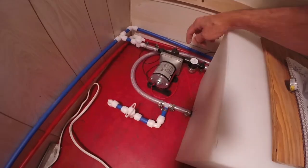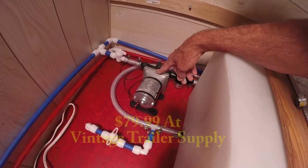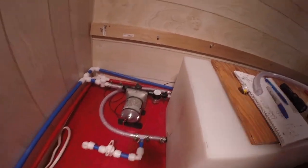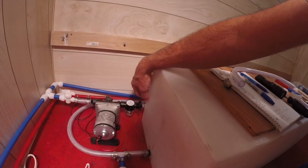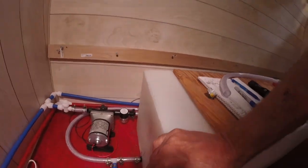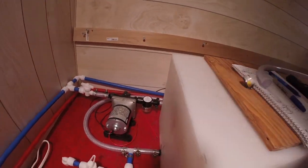This is our Sure-Flow pump — I think it's three gallons per minute and 60 pounds per square inch. You have to get this filter going from the tank water into the pump, because without it you don't have a warranty for your pump. It's only $11 for the filter — it's got a screen in it, you can clean it or change it.